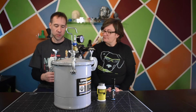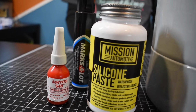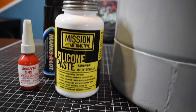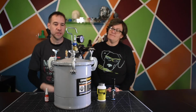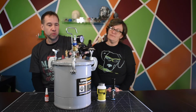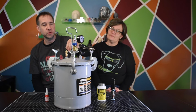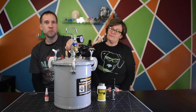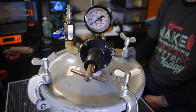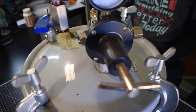Okay. So in the second video I mentioned that Zac Higgins does, he suggests using this thread locker, Loctite 545, instead of thread tape. And I used that, and it seemed to work pretty well. When you use it, any runoff seems to stay wet, and you might think, well, man, when is this stuff gonna cure? But it actually is anaerobic, and it cures in the absence of oxygen. So inside where the threads are locked together, that has dried and cured. You just can't see it.